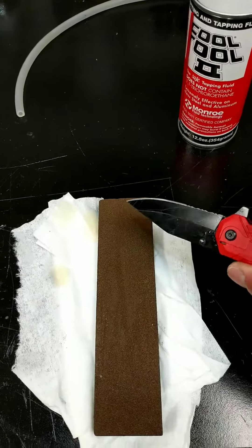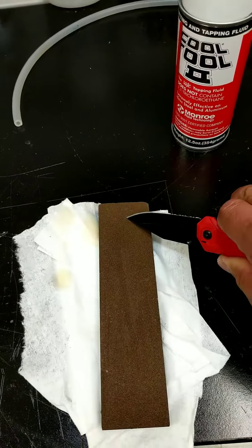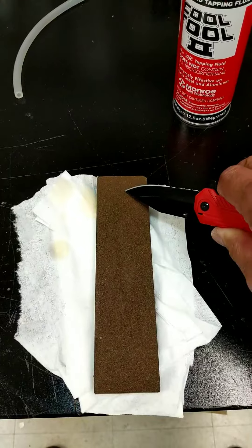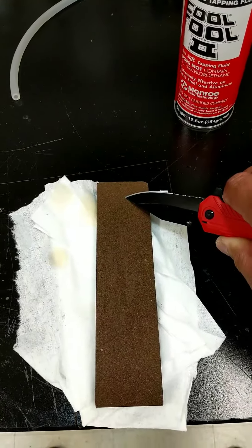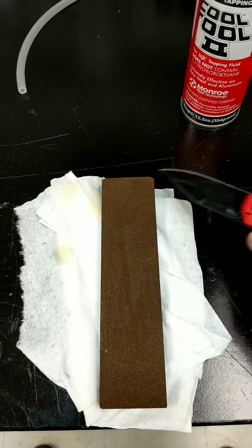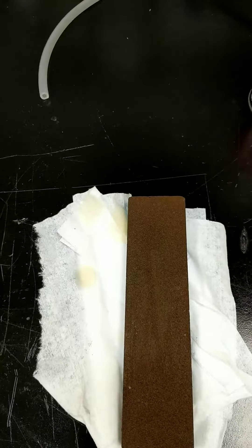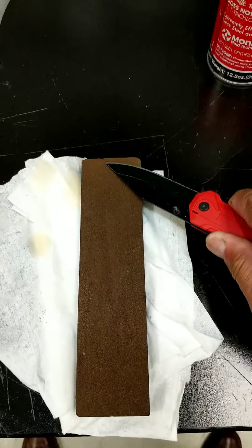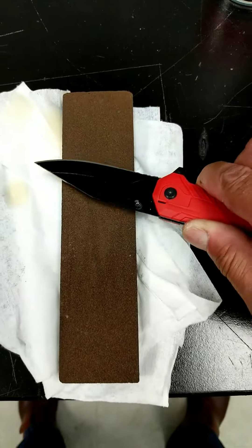Applying your fluid here at the top of the stone. Depending on the amount or the remaining edge left on your knife - some knives can get pretty dull - you would start using the left right, left right even stroke application method, applying your lubrication here at the top. Just as a demonstration, you would spray here and draw the blade using this exact pattern I'm showing you at a preset angle which you will learn over time.